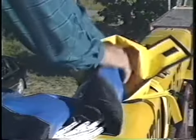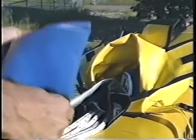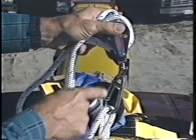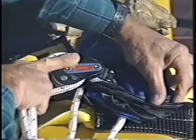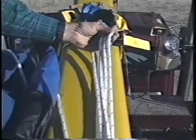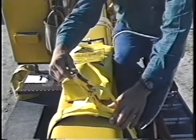Once a month, it is important to inspect inside of the rescue kit. Begin by inspecting the inner bag's stitching for loose, cut, or frayed threads. Also, it is important to inspect the carabiner, shackles, blocks, and connecting pins for breaks, cracks, deformations, or loose parts. Remember to inspect the rope for cuts, frays, and extreme wear. If during your inspection you find an item that requires attention, remove it from service immediately.